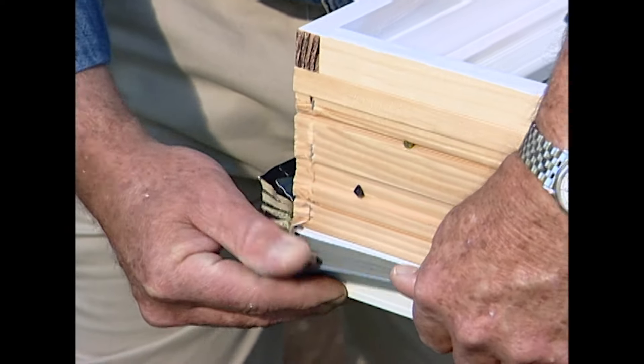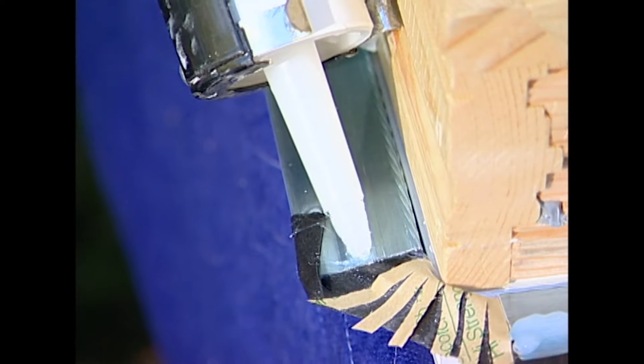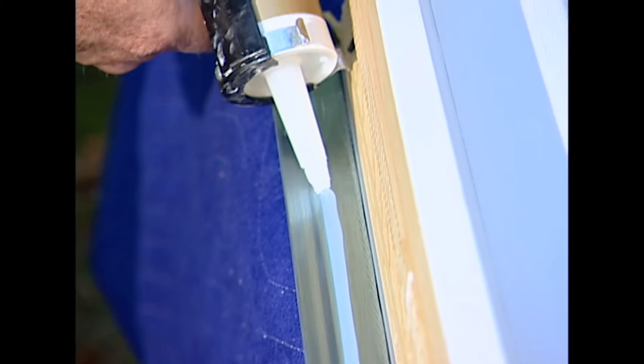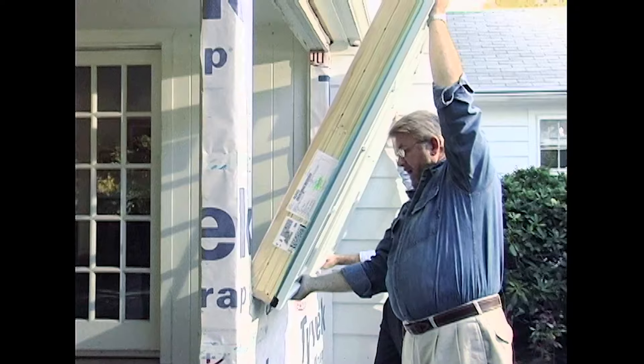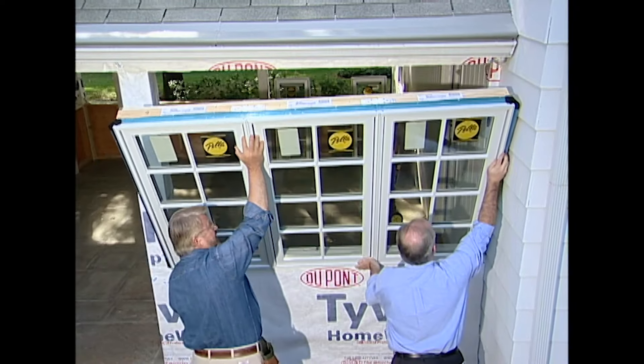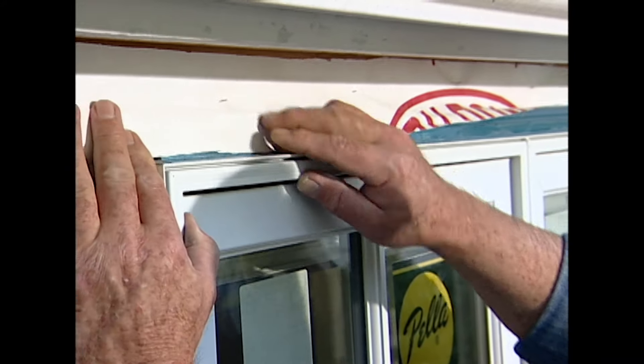My new windows come with a metal flange that must be bent outward so that it's perpendicular to the window frame. The weathertight seal comes from a bead of caulk applied to the inside of the flange. Installing these windows — at least the larger ones — is definitely a two-person job, so I recruit my neighbor Peter to come over and lend a hand. After setting the bottom of the window on the finished opening, we just tilt it up into position. At the top, I make sure the house wrap laps over the flange, then nail the window in place.